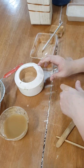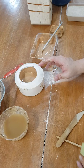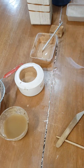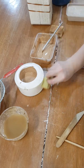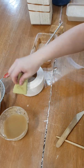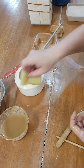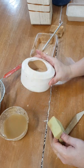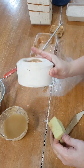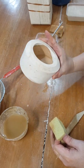This you have to try. So in most cases, it's between about 5 minutes to 10 minutes. If you just leave it like solid like that, you never pour it out, you're eventually gonna get a very solid clay that just dries up in the bottom, right? So you do want to pour it out eventually after it's built up enough thickness.